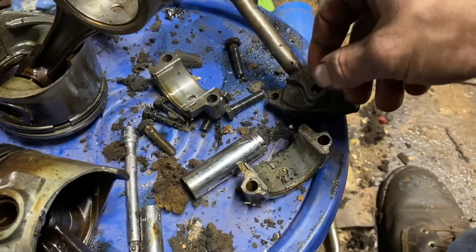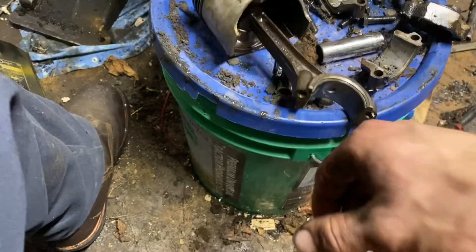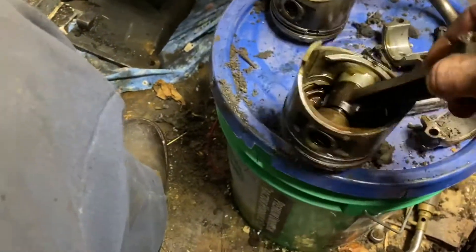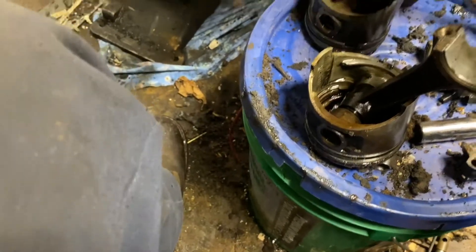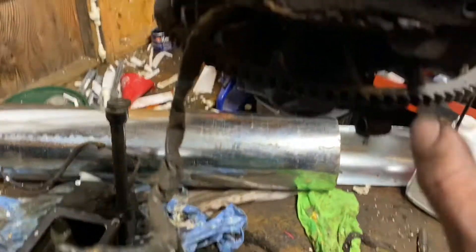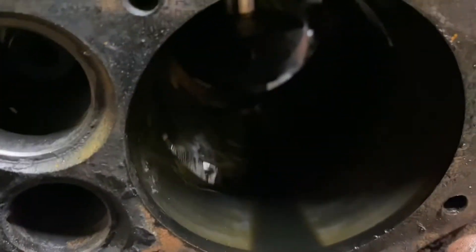So I have four bearings, a gasket for the oil pump, and rings to order. I don't think I'll even bother pulling the wrist pins out — they seem like they're in real good shape. As for the cylinder walls, they don't look too terrible either. There's some pitting — maybe that might be my issue. I'll see about honing it because it looks like it's pitted or scratched. This is the lower side; the upper side was the side that was giving me fits.